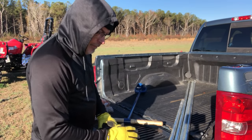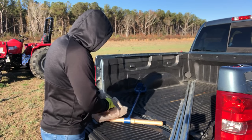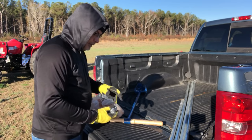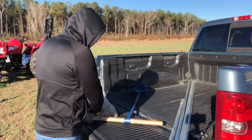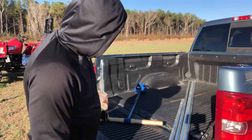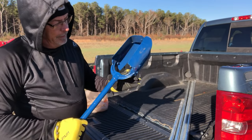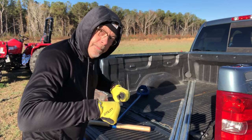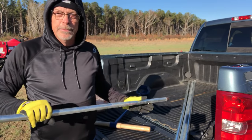So I'll show you what I got over here on the truck from Home Depot. Okay, everything we need to drill this well is right here. I bought 4 of the couplings. They're 3/4-inch threaded iron couplings. Don't need much more than that. Once I separate the rig here and unthread that, once it gets down handle depth in the dirt, I'll add a 5-foot section of 3/4-inch threaded pipe.